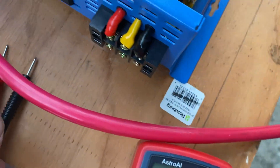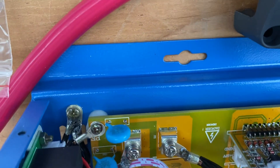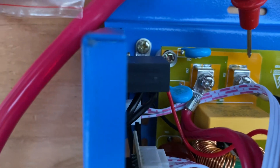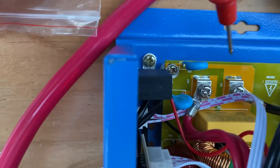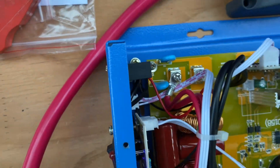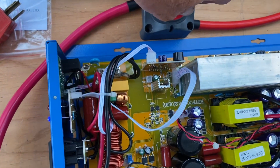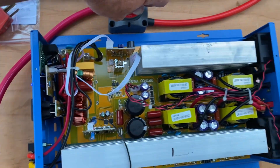So as with the reliable inverter, these units are cross-wired. Again, what we need to do is reverse these two screws — there's a black wire and a red wire — they just need to be reversed. I'm going to do that now and pop another video. This is part one; part two is coming.